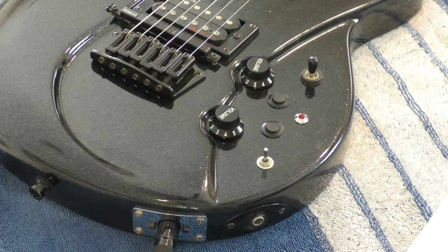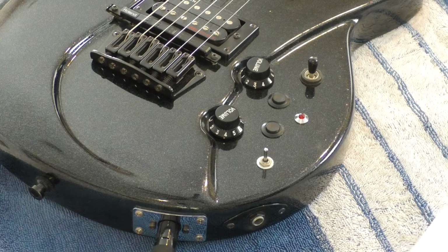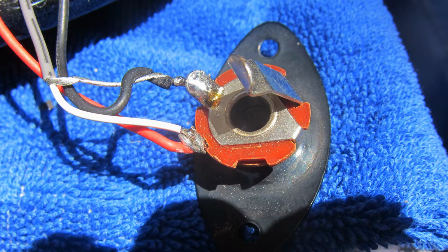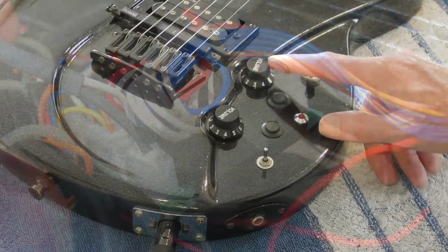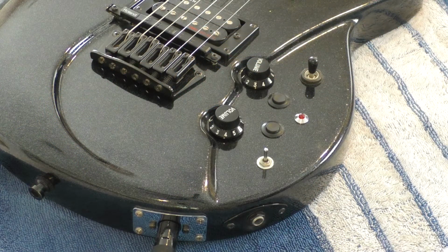Anyway, to fix this for this guitar, I was lucky enough to happen to have a connector in my GK parts box. I wired that to the 1/4-inch output, plugged it into the normal guitar input on the GK card, and then snipped the wire that ran from the 3-position toggle switch to the outside lug on the volume control. And now everything works great, and the sound from the switch humbuckers is pretty awesome.